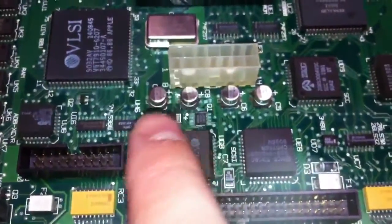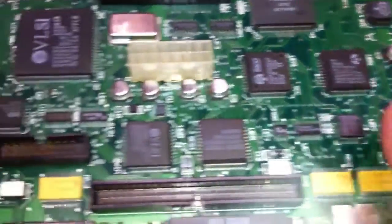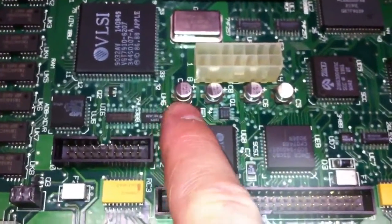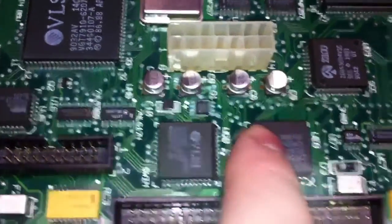As you can see, the rust on this one is insane. In your case, the main board just slides out on little rails on the side — pull the motherboard straight out. Now let me show you the problem: there are four capacitors on the board here and another four capacitors on the main board. These are what's causing your checkerboard problem. They leak — there's liquid inside them that spreads all over the board.